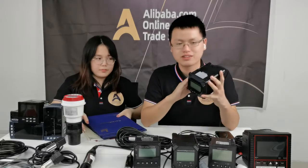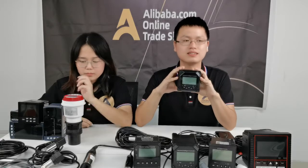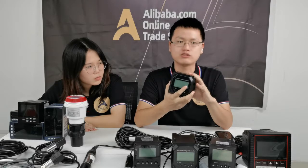Let's come back to our product. This is our new model pH controller, which offers a very reliable method of pH measurement and pH controlling. It is very necessary in applications such as water treatment, food and beverage processing, and chemical industry. This pH model's standard functions include digital display of pH reading from pH 0 to pH 14, and ORP reading from minus 2,000 millivolts to 2,000 millivolts. Additional functions also include temperature, dual relay, and ORP or pH calibration.